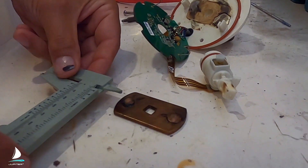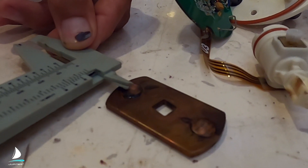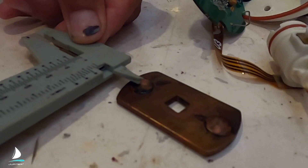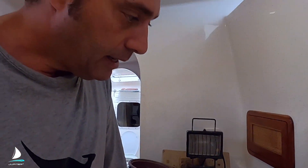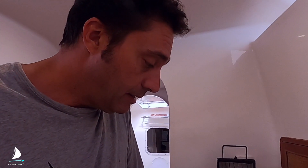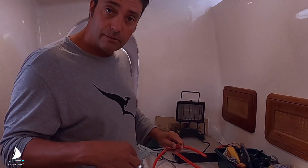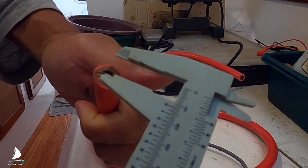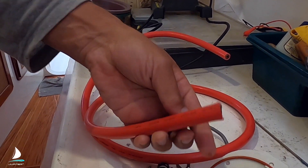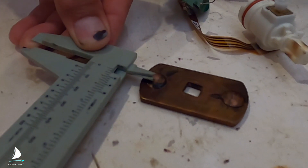I can see the shiny part of this contact — the part that is making contact with the studs — and it's only about four or five millimeters of shine. I'm only ever using a maximum of 160 amps through this for short periods, normally less than 100 amps, yet it's rated at 600 amps continuous. But this is the battery cable recommended for around 200 amps — it's 50 millimeter squared cross section — yet it's running through a contact of only four or five millimeters.